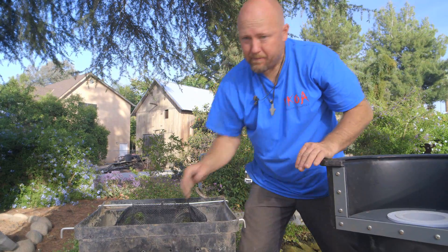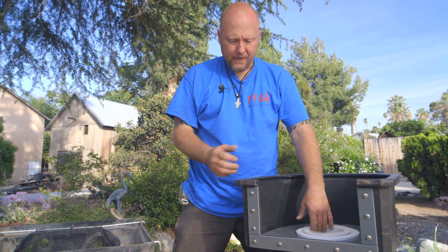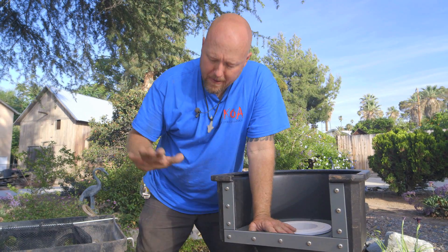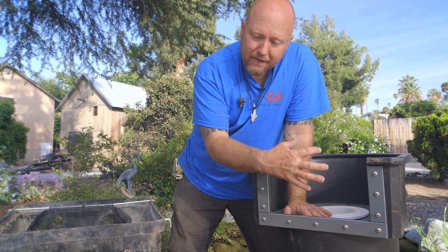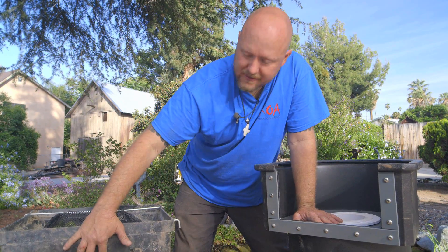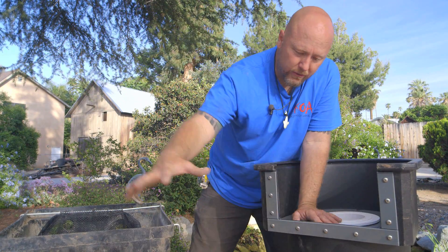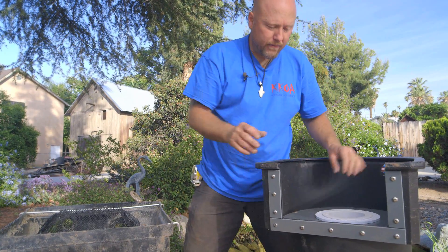As I said, it served us really well for many years. But with the new technology, I have this nice wide throat that's open. When we were pulling this skimmer out of the ground, the water hyacinth was caught in the front — a couple of small pieces — because the opening was trapping the stuff. With this wide throat, any debris can come in; if you have a lot of debris on top of the pond, it'll make its way into the throat.